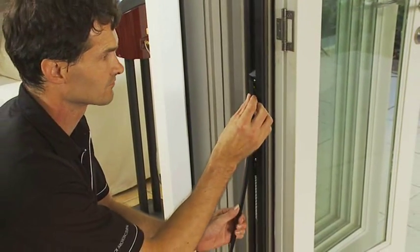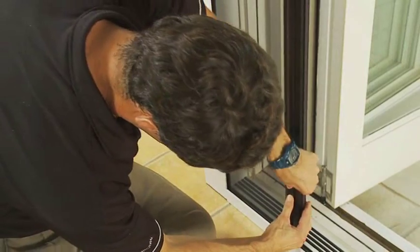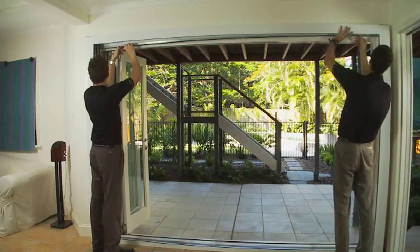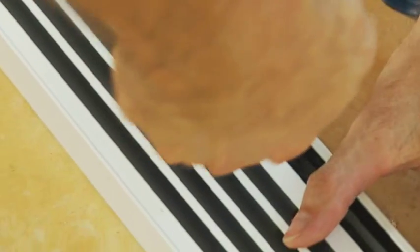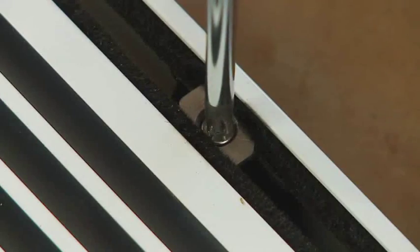Place the jamb stop containing the magnet in the jamb and snap it in. This jamb stop is only required for a single screen unit. Place the head cover in the head and snap it in. If you have a double screen, there will be a stile stop located within the sill. Position the stop as required and fix down by locking off the doorstop.